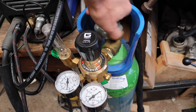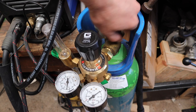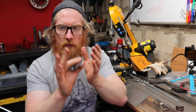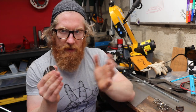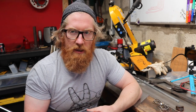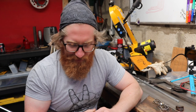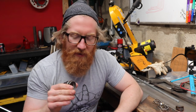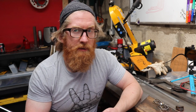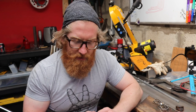I know, speaking from a lot of people, you have to back purge when you come to weld the full system, meaning that you have to close each of the ends and around the exhaust and fill it with an inert gas. Also, something to do with magic that happens when you TIG without it, because it's a shitty weld. There is a reason for it, I can't remember right now. But I've got back purge equipment coming, should arrive tomorrow. But for me tacking these things together right now, that should be okay.